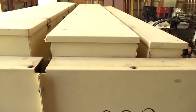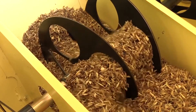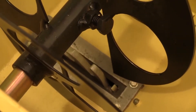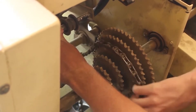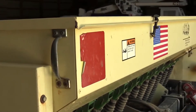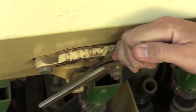The center box is a native grass or fluffy seed box, made to handle fluffy seed that is seeded with lots of chaff, like big and little bluestem as well as Indian grass. The fluffy seed box has augers and picker wheels that help the seed flow through the drill. The seed rate for this box can be adjusted by the chain and gear system below the safety shield on the front of the drill. The rear box is the grain box, made for large seeds like soybeans, oats, wheat, and other grains.